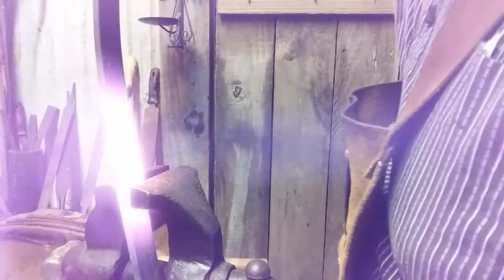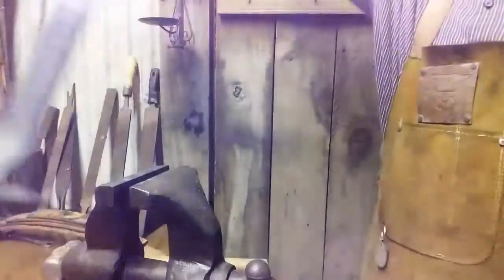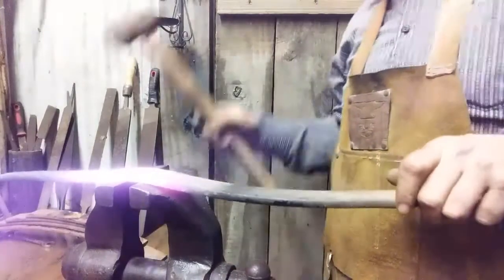Target area heated. I mean, you don't have to put a lot of pressure at all. You can get this straightened out fairly easily. Now that bowed up. Although you'll be tempted, don't reach up the bar of steel, because the heat gets proportionally greater.